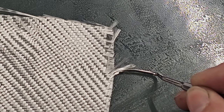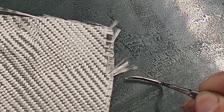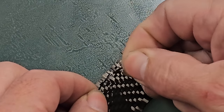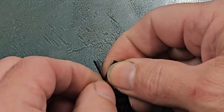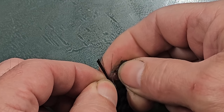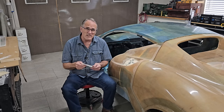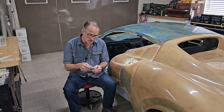Composite cloths are thousands of bundles of fibers waiting to join in a matrix. Thousands of strands of fibers make up what is known as a tow, and then the tows are woven or bonded together. Carbon fiber is often designated by the number of fibers in each tow. Here in this 2K twill fabric each bundle has 2K, or 2,000 strands. When you add resin to a piece of cloth you get many bundles all working together, and as you stack layers together you compound the benefits.